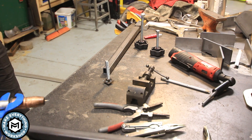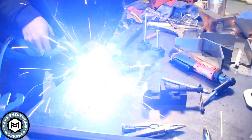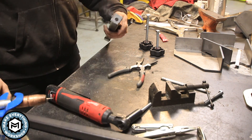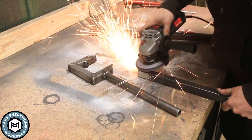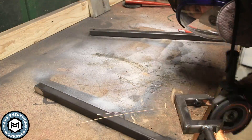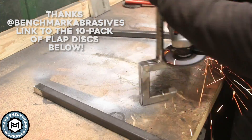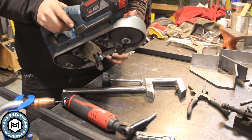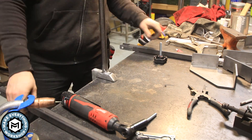That's going to get welded into the top of this post. Once that's welded into the top, it's going to give me a nice solid thread beneath the surface, so that from above it just looks like a tapped piece of plate, but there's a nice nut in there that it can really thread into. And that's going to hold the light itself. With everything welded up, I head over to my little grinding area and I just head at it with an 80 grit flap disc. This is from Benchmark Abrasives — they have a fantastic 10 pack of 80 grit or 40 grit zirconium flap discs. It's like under $20 — the best price you are going to get flap discs for, and they last extremely well. With that Loctite dried up, I can cut the ends off this hardware and get my clamp nuts and bolts into their final position.